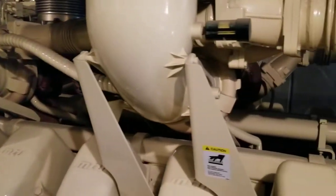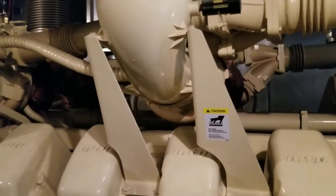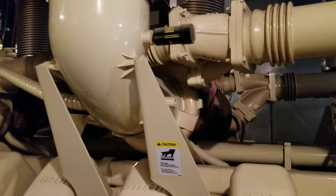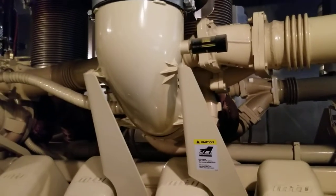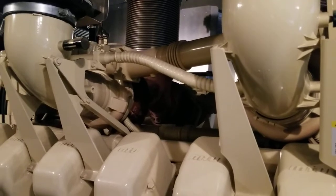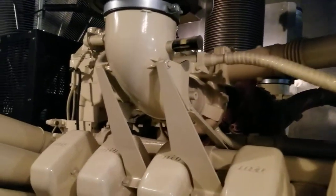Because these need to spin up so fast, this engine has six turbochargers. I've seen the same engine with two really large turbochargers, but having six makes the engine spool up faster and react to instantaneous power draw faster — or so I'm told.